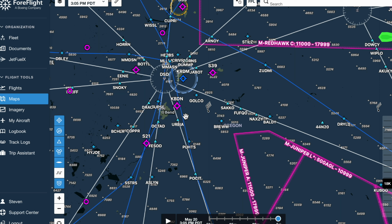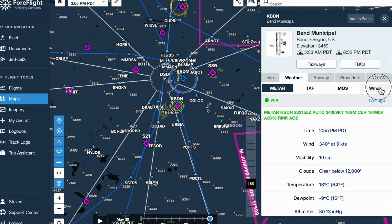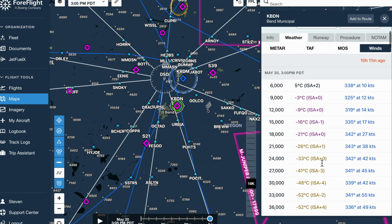If you don't have a modern avionics suite, you still need to do this. So you just need the outside air temperature, or you could probably just look at the ForeFlight temps aloft over your airfield and trust those. And while you're there, take a look at the winds aloft to get an idea of what to expect. You'll need to record your GPS track, so you will need a GPS to do it, at least with this method. You could use ForeFlight on your phone. You could use another device that has GPS tracking. And then that is to record your ground speed. Okay, write down the barometric pressure so that we can correct for pressure altitude, as well as true airspeed, and then you'll have all the data you need.